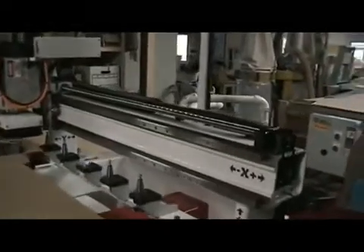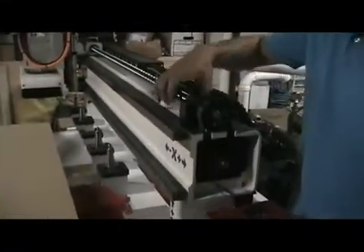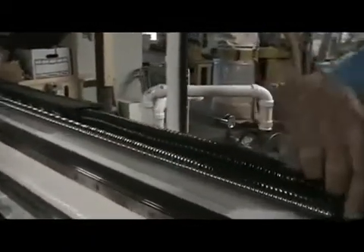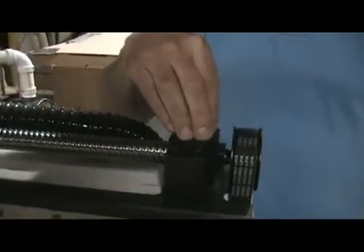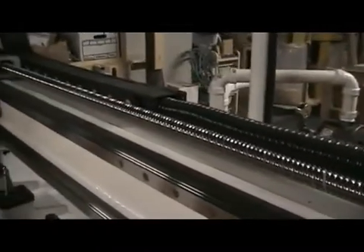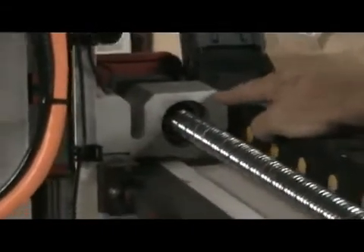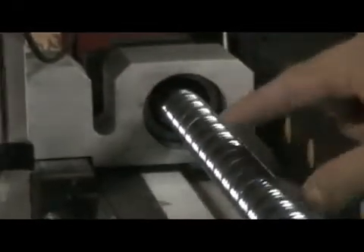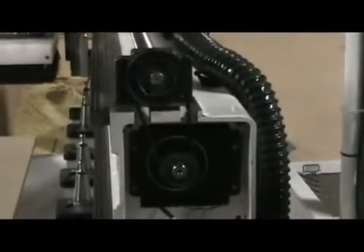Let's get a look at the ball screw. We've taken the cover plate off the machine here, and here's the ball screw across the X axis. Nice size precision ball screw here on the bridge axis. These are angular contact bearings on the ends of the ball screw — a beautiful bearing set. I see a lot of manufacturers in this price range turning their ball screws in brass bushings with no bearing at all, or using a very flimsy steel plate with a standard bearing shoved into it. Look at the nice machined bracket for holding the ball nut — everything on here is real precise, real industrial quality machine tool components. The brushless AC servo motors are tucked in the tube nicely with a timing belt pulley drive system. I would challenge you to find a more nicely appointed machine tool in this price range.